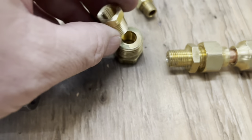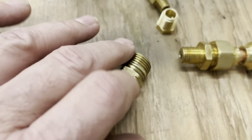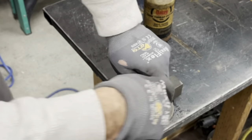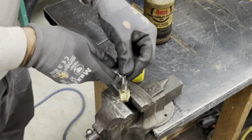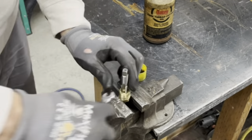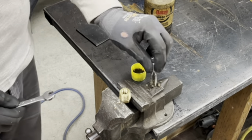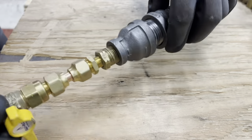This fitting here I've got to go both ways to be able to thread it, so that it will work for what we're doing. Some cutting oil and I've got my tap, just getting it started with a little bit of pressure. You can't use too much cutting oil.